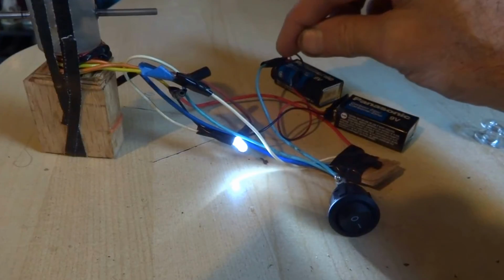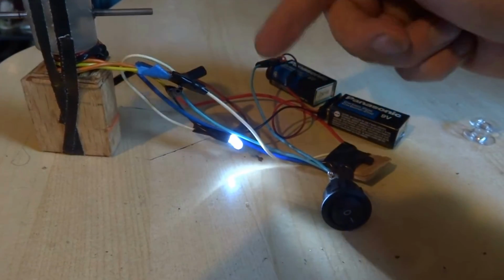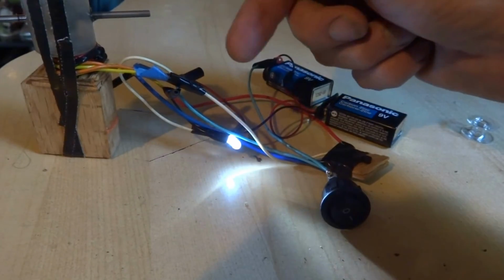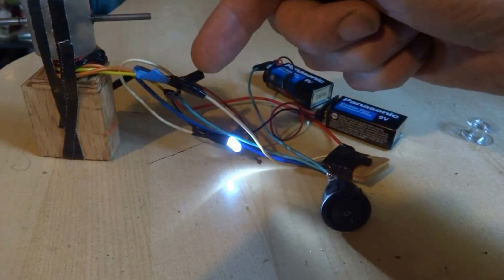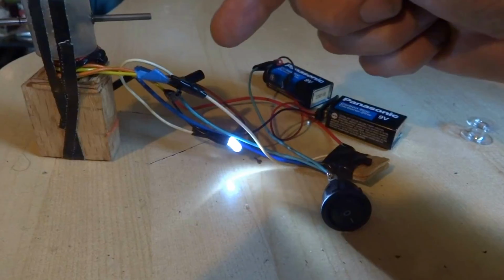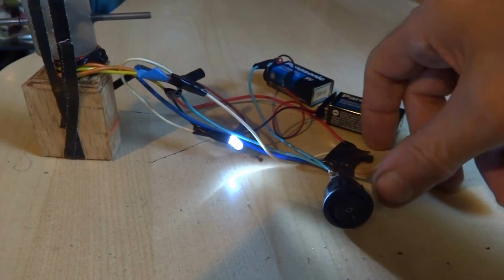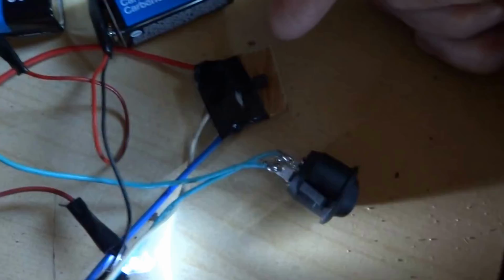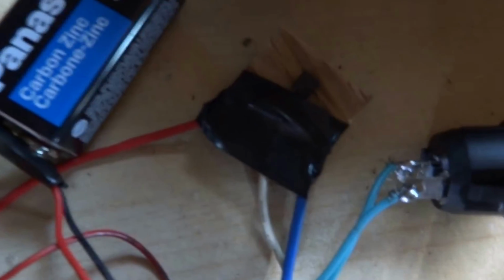And it's important to do that, because I found that when you're testing these out, if you've got your twisted wire and you haven't taped it with electrical tape, the shorts seem to burn out the transistor. Certain shorts do. Here's the transistor right here. Let me see if I can get my camera focused on this thing. Okay, there's the transistor right there.